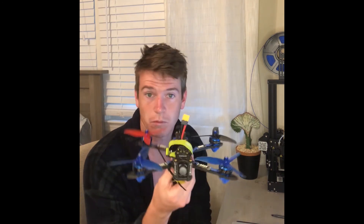Another thing to check in Betaflight is your receiver tab — make sure the input you give it is the correct input and that they're communicating. There are also different flight modes. In FPV acro mode, you don't use the accelerometer and there's no self-leveling. Self-level mode keeps the drone level. If your quad is always flipping on takeoff, you can check if the accelerometer is the issue by switching to acro mode or disabling self-level mode.